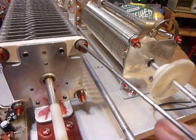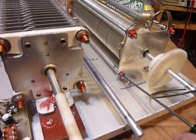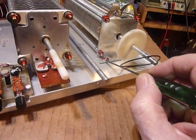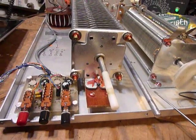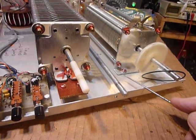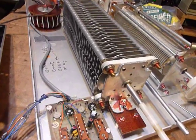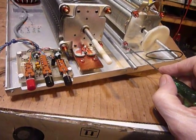You can see here I put little dabs of red nail polish on the screws. Many years ago I was working on surplus equipment and they had put a dab of red paint on all the soldered connections and all the screws and bolts. I spoke to my friend W9OPT, Don Smith, who had been in the military. He said yeah, some of that military gear they check it out very thoroughly — when they solder a connection they put a little dab of red paint on it and on the screws and bolts to indicate it has been inspected, checked to be tight and correct. On aircraft gear, a loose connection or loose nut and bolt could really cause trouble.